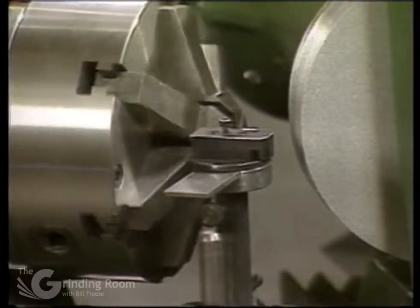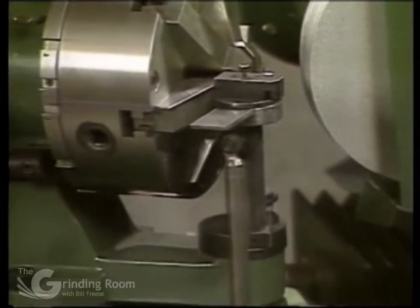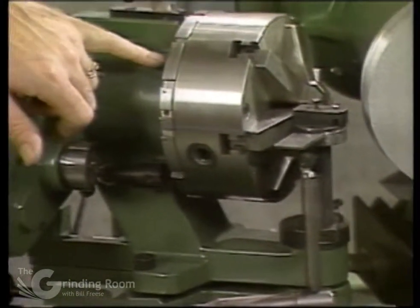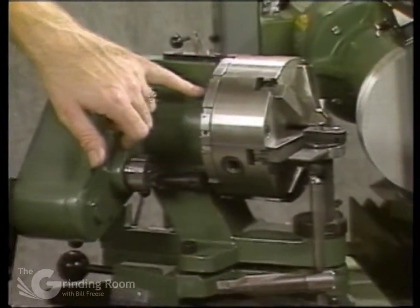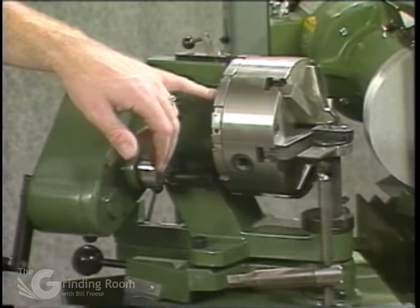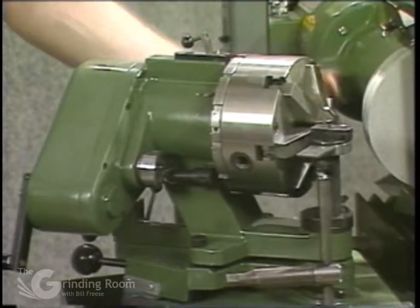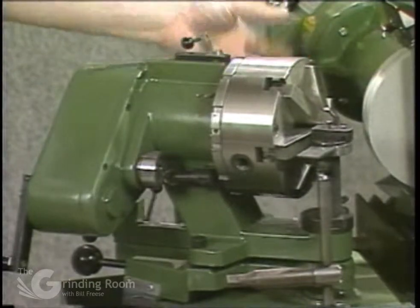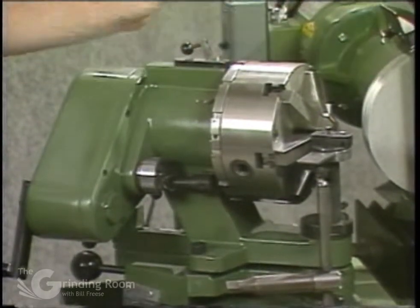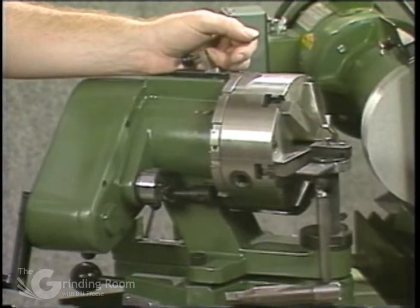You can see the action you're going to get on the drill. The other consideration here is setting the amount of heel relief on the drill. Now in our manual, we have recommended settings for different size drills and different angles, so you can use that as a guideline. In this case, I have a half-inch drill at 118 degrees. I'll be setting the relief drop at 12. That's done by moving the lever here — it's a ball detent, so you have to sort of pop the handle with your hand to make it move into the next hole.